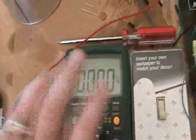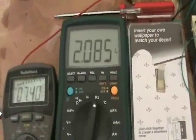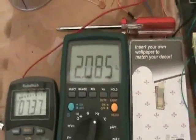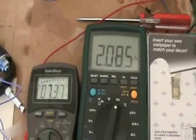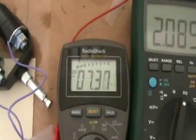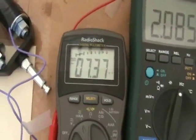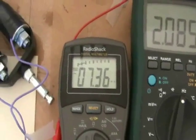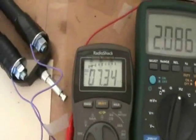The right meter is the frequency. When I turn this on, I have this pulsing at around 2.085 kilohertz, so this is in the audio range. This is the current that can flow through the meter across the tank circuit. There's no antenna and ground hooked up — this is just directly across the tank circuit.